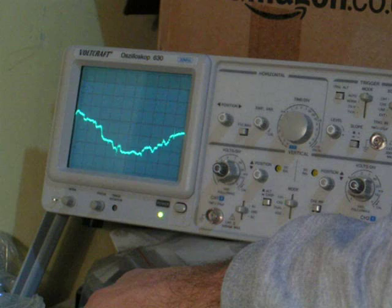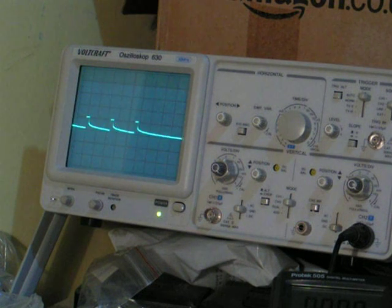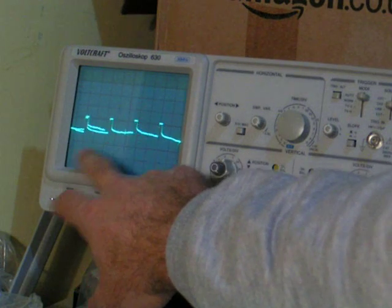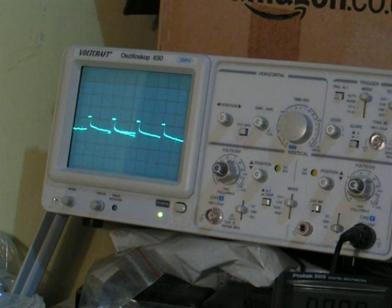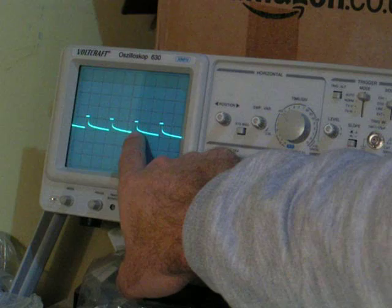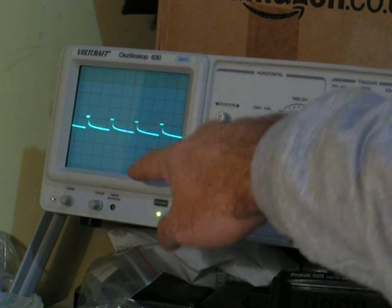We have a small chaos here but I'm trying to fix it. Can you see the peaks over there? We have 2 milliseconds per division spacing, so that's approximately 4 milliseconds distance between the two peaks, which look like square waves. This is one time slot our mobile phone is using, and it repeats every approximately 4.6 milliseconds according to the GSM standard. So we have locked it — the vertical division is about 500 millivolts per division, so we have something like a 2 volt peak signal.